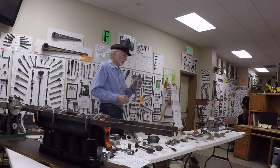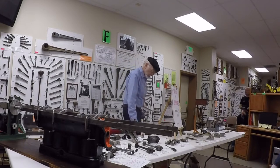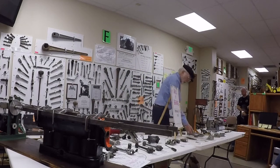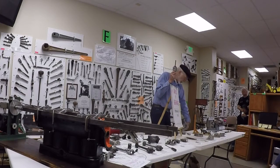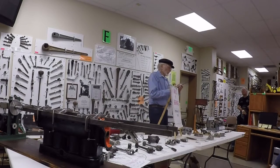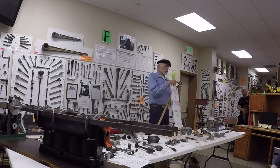This gadget is another homemade thing. This is an adjustable boring head - for those of you that are machinist oriented, they use them in a milling machine. It's got an R8 taper and a dial over here; stick an Allen wrench in, loosen the set screws, and you crank it over so many thousandths and it moves away from center - the farther from center, the bigger circle it makes. So I used it to bore that connecting rod.